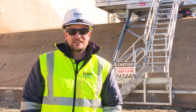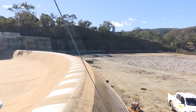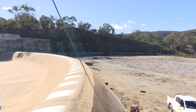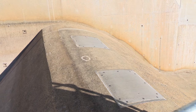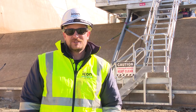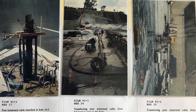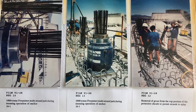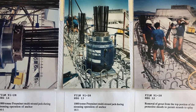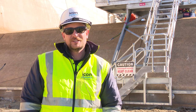A decision was taken to strengthen the spillway by installing post-tension anchors — 48 of them spread evenly across the crest of the spillway. What the anchors essentially are is a series of steel cables anchored into the bedrock below the spillway, about 30 metres deep. At the time they were installed, they were put under tension and locked off at a predetermined load.